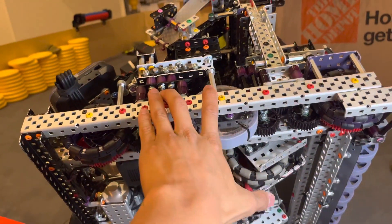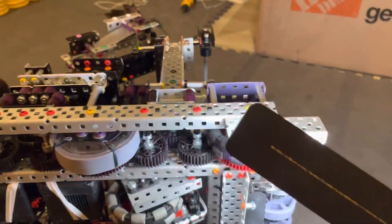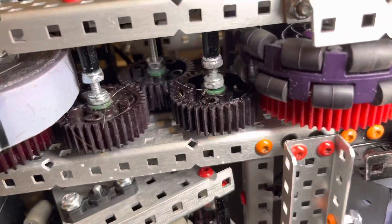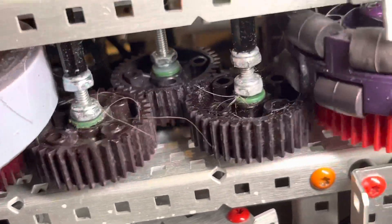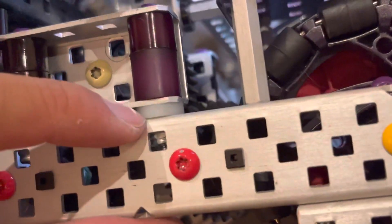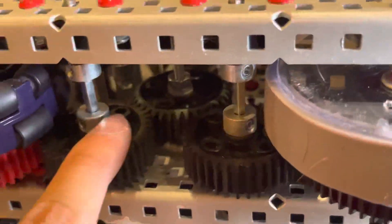To get the drivetrain size that we wanted, we used a gear offset. We basically have this offset here so everything drives in the right direction. We have screw joints on everything — the standard stuff. The offset gear is placed with a 0.125-inch spacer above, and it's the same on either side.